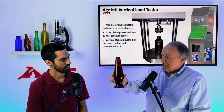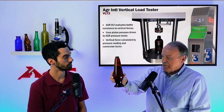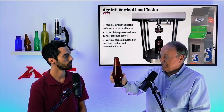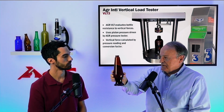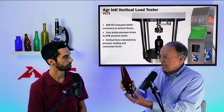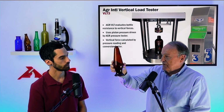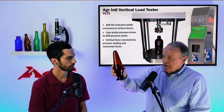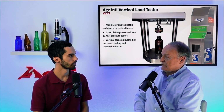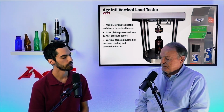And this particular bottle was, I think, the second generation of the Michelob shape, and it did not perform well in a capping operation. And so they had to modify this even further by raising the heel contact point and rounding out this very, very pronounced heel shape, very pinched, into something more rounded. And that's the shape that you normally associate with the old style of Michelob bottles in the past. Okay. Well, that's very interesting.